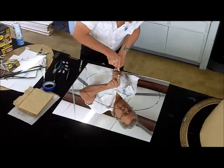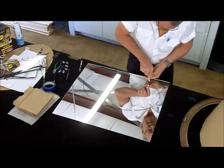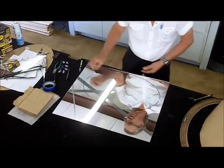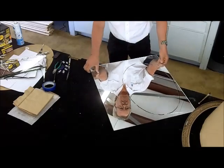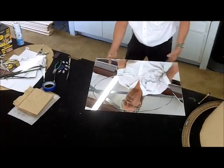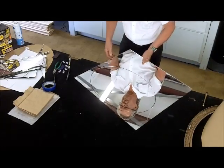You may notice that I zipped off the edge leaving what's known as a vent. It gives you a place to start the run, as you'll see here. Chase the run around the edges so that the glass is broken free.